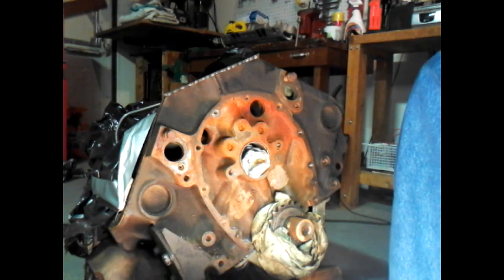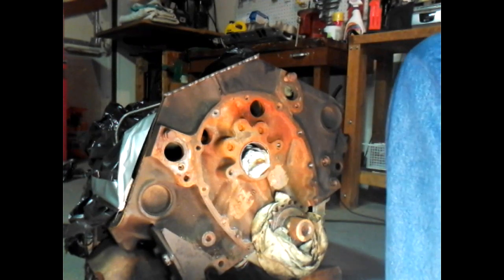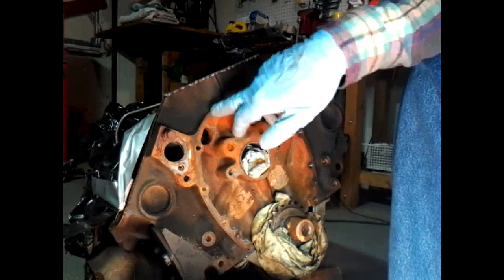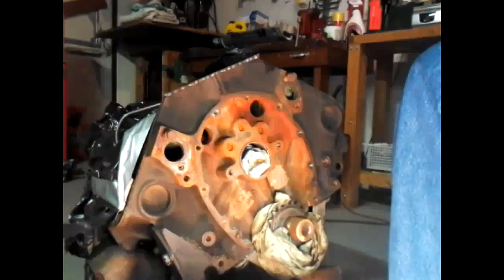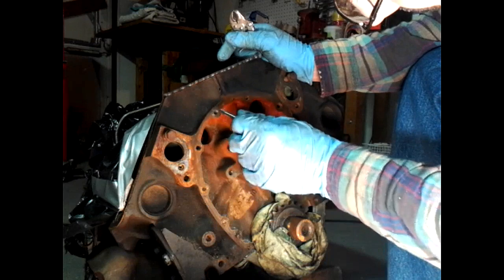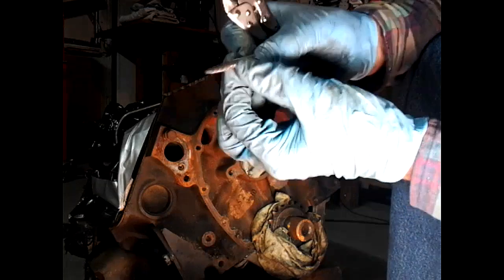Now that you've made a pretty decent hole in the middle of the actual screw that's left in there, the next thing you do is get your screw extractor. You can also go ahead and drill through the whole thing and just re-tap the thread — I have a video that shows how to re-tap. This extractor, you have to go left-handed with it. It will go into the hole that's drilled, dig in there, and turn it out.